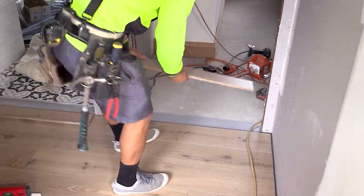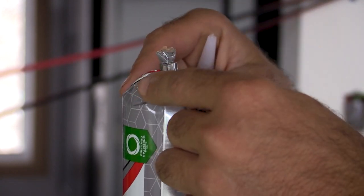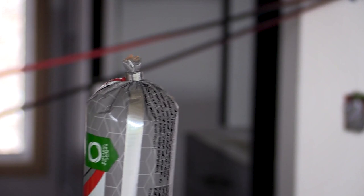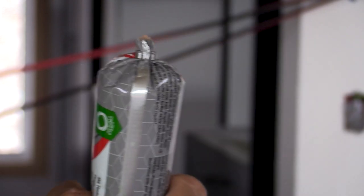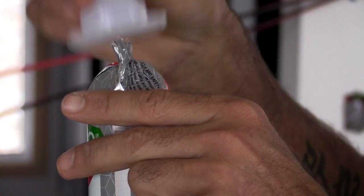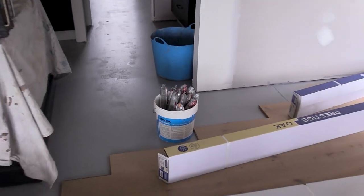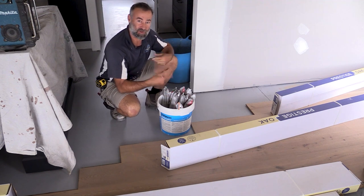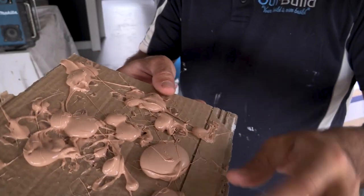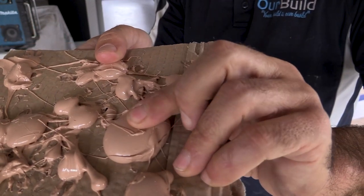Here's a little tip for opening up the top of these sausages - sometimes when you cut them they can fold out and it causes all the glue to ooze around the base of the nozzle making it quite messy. Just use this metal ring to open that up - it makes it so much easier because all of the paper of the sausage can slide inside there and ooze up inside the actual nozzle itself, it's just way less messy. You can see here we're opening a few up and dropping them in the bucket to speed things along - because there's two of us, one can be gluing two boards out while the other pops them on top. The glue is incredibly flexible when dry - like a little rubber dollop.